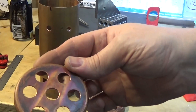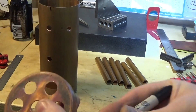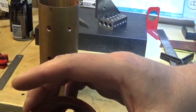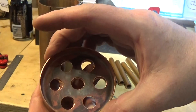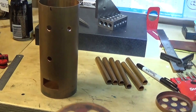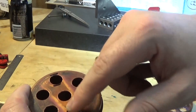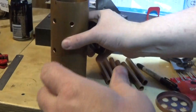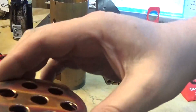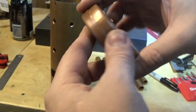One of them's offset — one hole is supposed to be offset. That's for the steam dome or the pressure gauge. If we have it too close or back on the PCD, what's going to happen is that it's going to foul with the chimney in the middle, so I've moved that one out. The corresponding hole in the bottom is for a bush, and that's for the blow-down valve, so there's no tube in that.